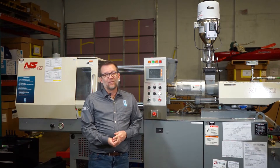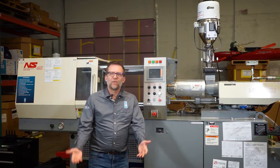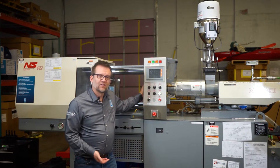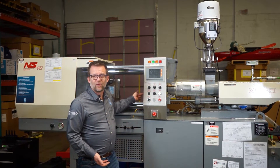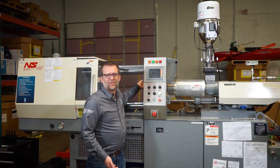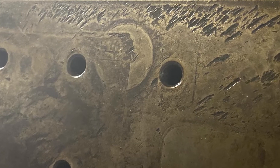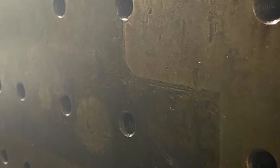There are a few things we need to take care of at every mold change, or at least on a weekly cadence. I'm going to give you some basic things to take care of your platens, how to take care of the threaded holes in your platen for the clamp bolts, and a little bit of self-care on the locating ring bushing. These are things that get damaged — we get buildup on the platen that looks like rust or a darker color.